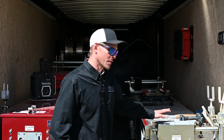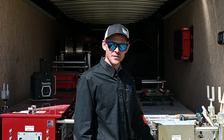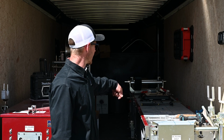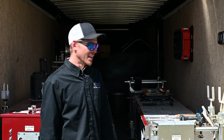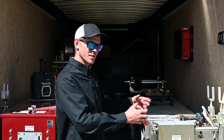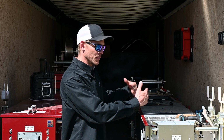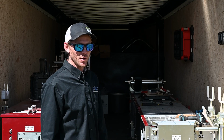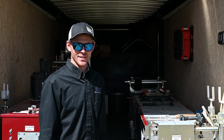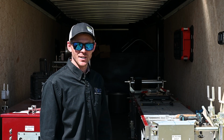As I said before, it's a 5-6-inch combo, similar to the 5-6-inch combo K-style. They just have you swap out the guillotine, and then there's a bunch of pins in there. You basically just widen everything up. It's a little more complicated. There's a rail of rollers that you have to bolt in for the lip former part, and you move some rails around in there, and it's pretty cool. I did it this morning and it worked out really well. It runs out really nice 6-inch gutter. I just switched it from 5 to 6, so it's super simple. I didn't have to tinker around with it at all.